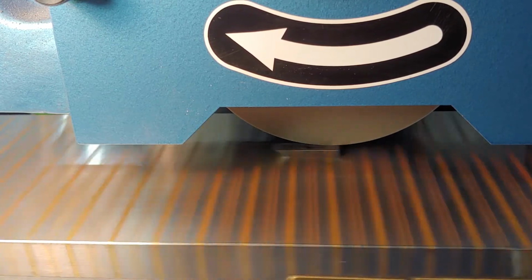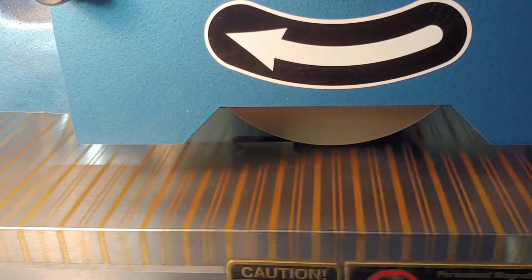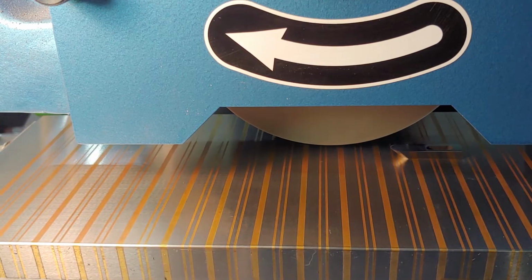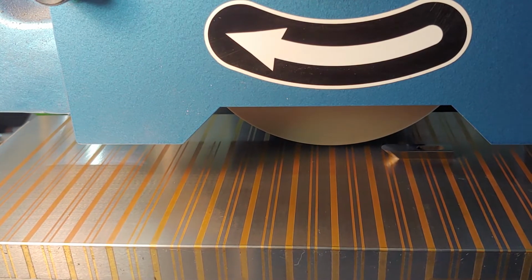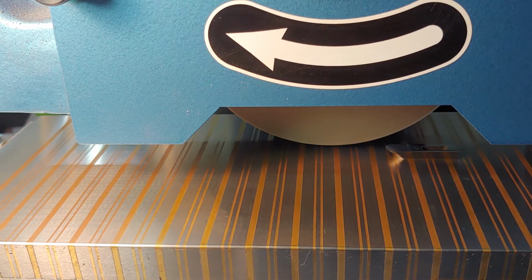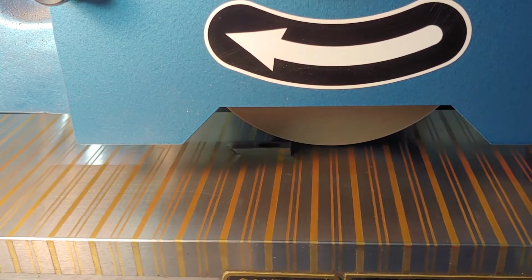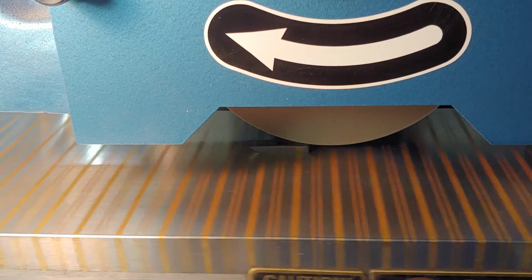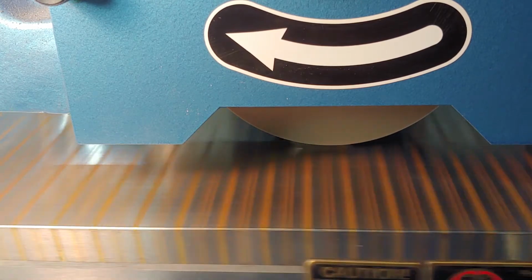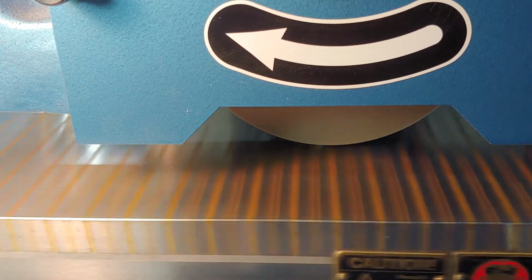All right, I've got a little bit too low. No problem. I just want to go over the whole surface and see if there are any high spots. Don't seem to be. And when I'm lowering this wheel down, it is by about 1/10,000th of an inch. So you should go a long time before needing a new blade. I've never seen one ground out that I can't use because it's just been too ground.